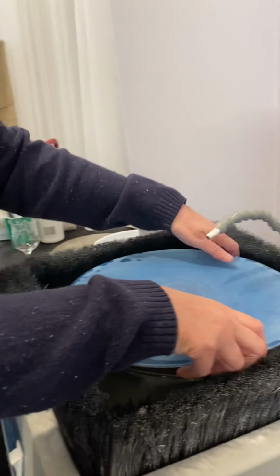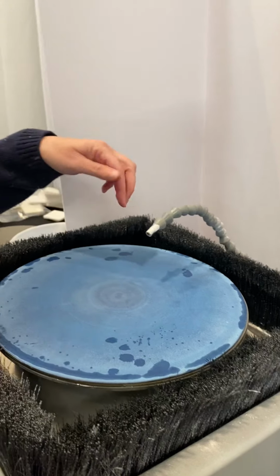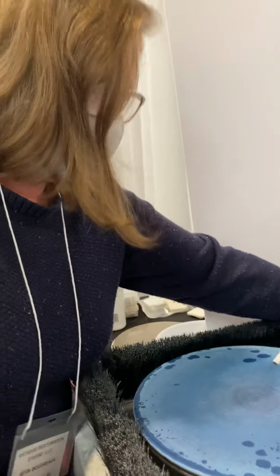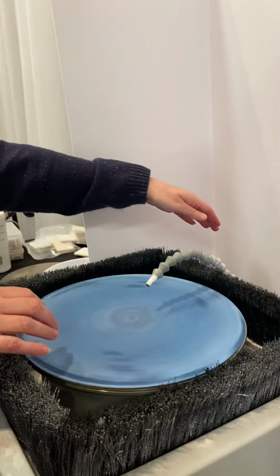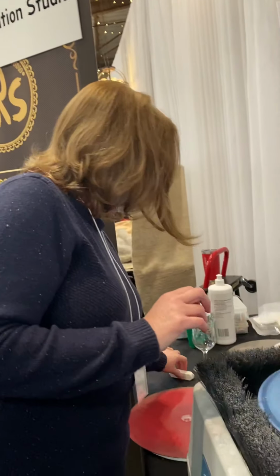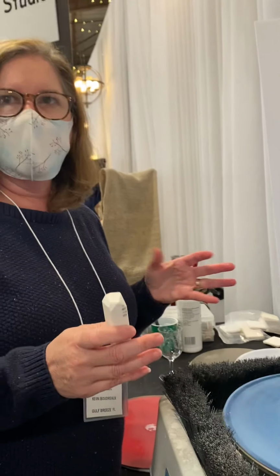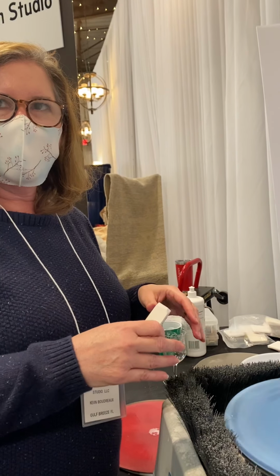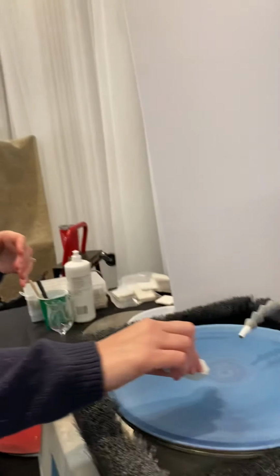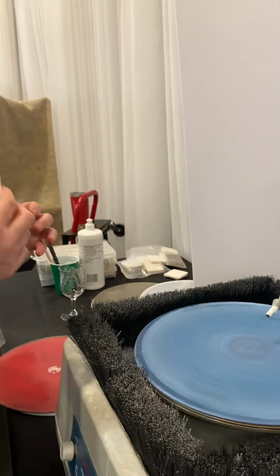How often do you go through these different polishing grits? Well, so far, I've had this machine for about 2 years, and I haven't had to replace anything yet. So they do last a long time. Whenever a diamond disc gets kind of cluttered with glass, resin, we'll take this and just go straight across it. It sharpens all the diamonds, so it does help the diamond discs to last a lot longer.